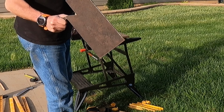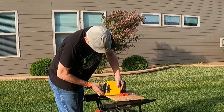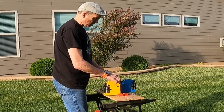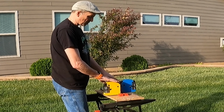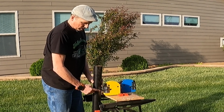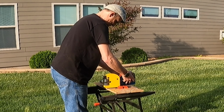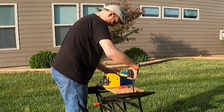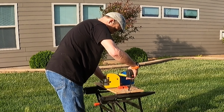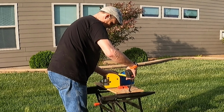So now let's look at our platform that we want to mount these on. I think one of these is going to go here and the other one the other way. Now we do need to make sure between our levers that we have enough room that the actuator rod can pass by on the outside of the main support tube. Move this over so we get a good 3 inches in between the edge of the jaw. That'll give us plenty of room in the center.